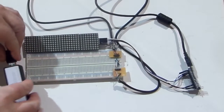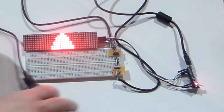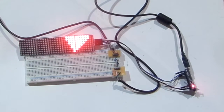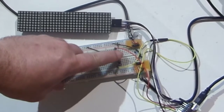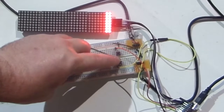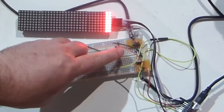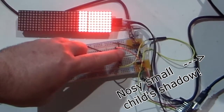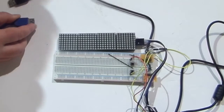We're ready for basic testing. Plugging back in on a power bank — didn't connect it to my computer just in case I'd done something dramatically wrong. We're going to test them over a range of currents, and to do that I'm using my matrix display. I've wired up a couple of push buttons and created software where I can light up individual columns of the display. The more columns that light up, the more current it draws, so we go up and take readings and compare them to what the multimeter says.